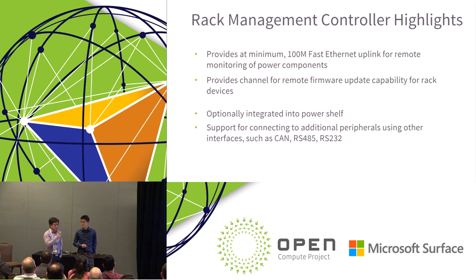I think this is a very detailed technical thing, and a very interesting question. In one section of the detailed specification, there's one particular column for what we call a high power tray removable from the rack level from the bus bar. If you are trying to cut off a high power tray, let's say 3 kilowatts, from the bus bar, you can easily create some issues, right? So we introduced some guidelines into the specification on how you should design your circuit to accommodate this kind of situation. You have all the details in the specification.